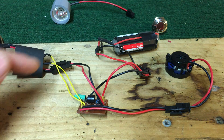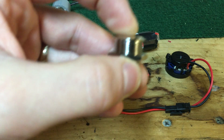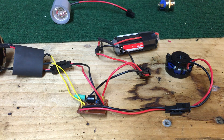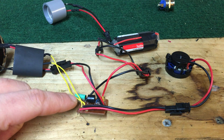You're going to need to change your switch from a latching switch — like the one you had in your stunt saber — to a momentary switch, so it only applies current when you press it. That's all you need for this board, and most higher-level boards are the same; I can't think of one that uses a latching switch. If you had it connected through a JST connector, it's just a matter of swapping the switch on that connector. It goes to the spots labeled SW on the board — there are two SW spots — and polarity doesn't matter on the switch.